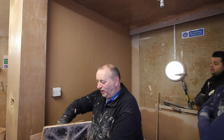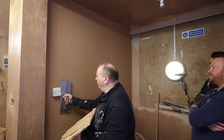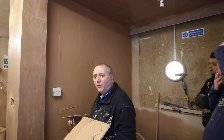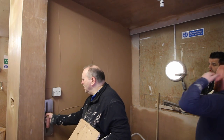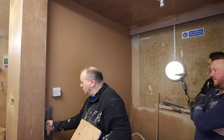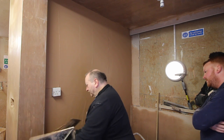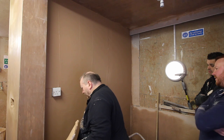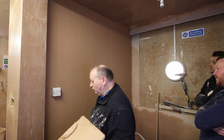So when you're trowelling it flat, you've got something to move. Because if you do it in one coat, you've nothing really to move, and if the stuff sets on you, you've got nothing that you can fill up with. So you always give it 2 coats. That's this area done down to here at the moment, so I've got to just finish that top half off.